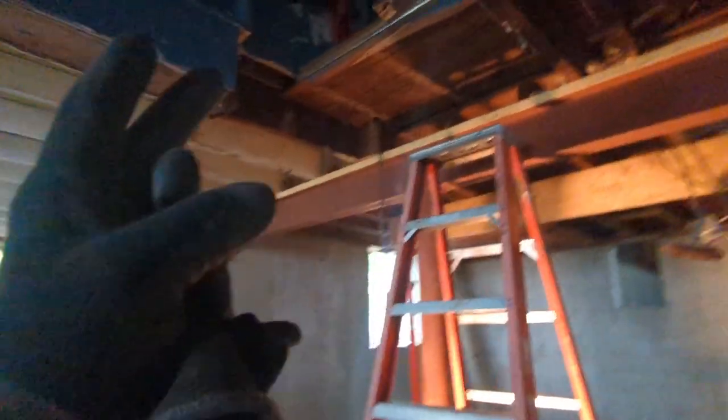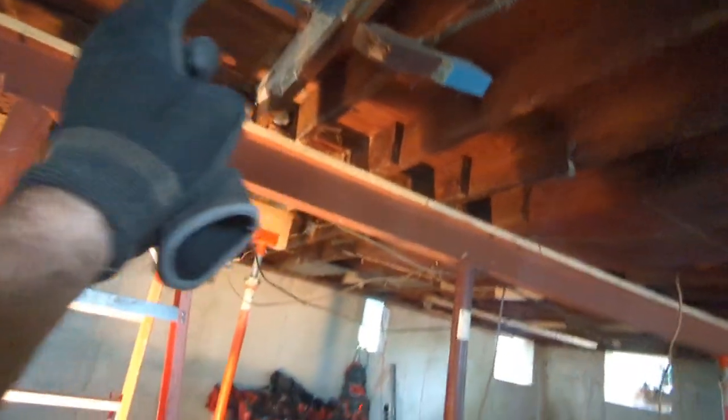And I don't want a sister on the far side of them because that's right into the stairwell again. But cut all those nails off and come down here. The problem is, oh no, there aren't any electrical penetrations in there, which is nice. So I'll get this 2x6 off. I thought these wires were going through that, but they're not. They just turn and go upstairs. Ooh, I don't know if there's room.